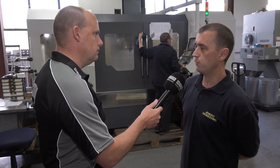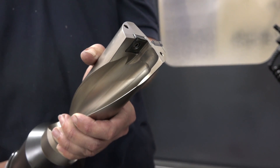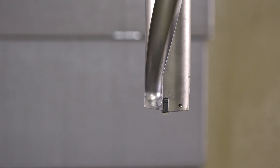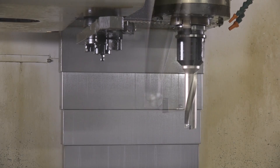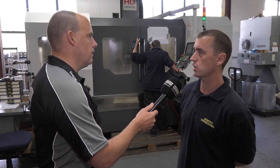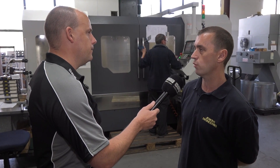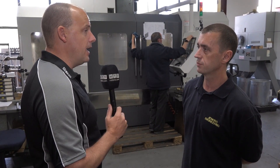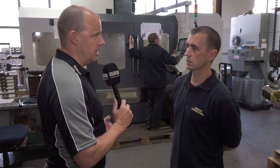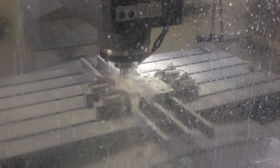Well, we're machining 55mm diameter holes with a U-drill at 0.1 per rev at 200 meters a minute, no pecks, straight through — which is virtually double the speed, double the feed that we were doing before. And having no problem, the tips are lasting longer. We've got through coolant on there obviously, so we're machining at double the feed that we were before. And you're getting better tool life because the machine is very rigid, so it's absorbing any of that U-drilling process. Yeah, the rigidity is fantastic, and that translates into other aspects other than just the drilling.